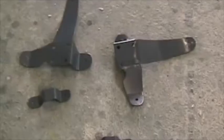Now I'm going to close the canopy, and then tomorrow I can clean this up and get a good fit between the canopy frame and the aircraft. There, I've waxed the pins once again so they don't stick. There, I've closed the canopy and squeezed away the excess micro on the sides. Once it's cured, I'll open it and then fill in any voids that there are underneath. This way I will know the exact thickness of the micro required in this gap.